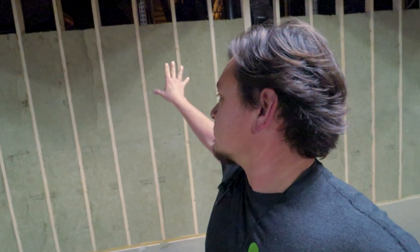In the walls here, we're using some rock wool insulation. We decided to go with that because since this is in a basement space, it can sometimes get a little damp on the other side of the wall. We're gonna try and run a dehumidifier over there as well as in here to keep that down. But even with temperature differences, you're gonna get condensation, and the rock wool does not grow any mold. It also kills down a little bit of the sound, and it's also a little bit of a fire barrier